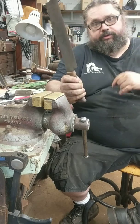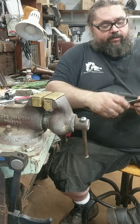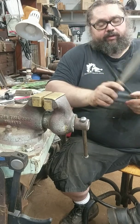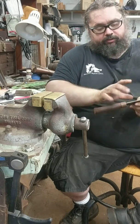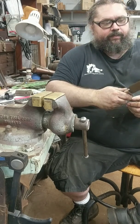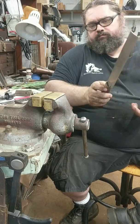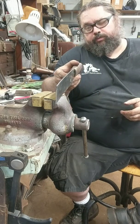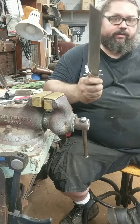This is my test knife that I made in the shop before I did my master smith performance test. This knife is 360 layers of 15N20 and 1095, hidden tang, 10 inches long, about 2 inches wide. It's been bent 12 to 15 times now, and you can see it's still pretty straight.